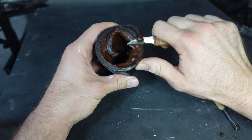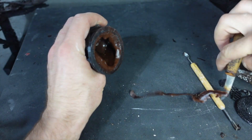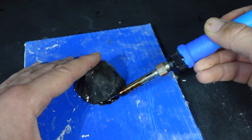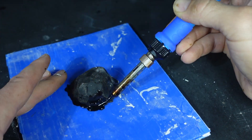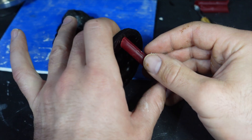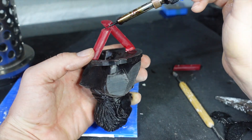As for my model, it was a little thin, so I coated the inside with a few layers of wax to help thicken it and help the metal flow into it better. I'll then take this piece of wax to act as a pouring funnel and to hold the sprues in place. I want to make sure no bubbles get trapped on the outer rim, so I'm going to add a lot of sprues around just to be sure it's vented well enough.